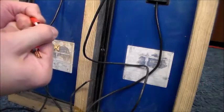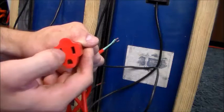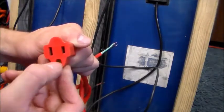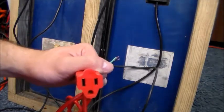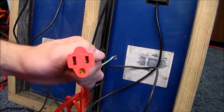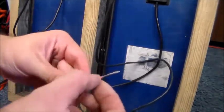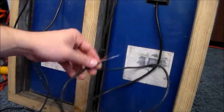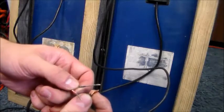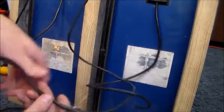So with the plug wired up, the two flat prongs on top were the power wires and I had a dedicated ground wire. Since I'm using 16-gauge wire, it's probably best to do it that way to avoid any power drop. The ground is a little more forgiving as far as keeping your voltage up. On these panels the wire looks like it might be 18 gauge — it's hard to tell, the printing is kind of faded.